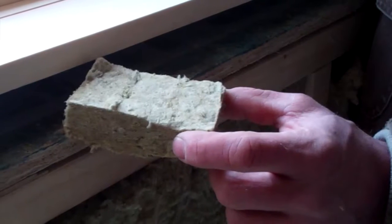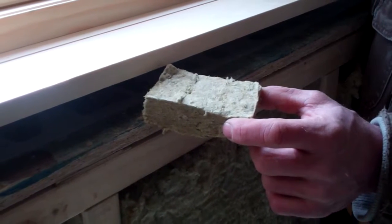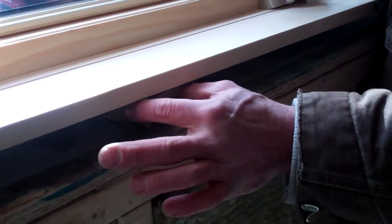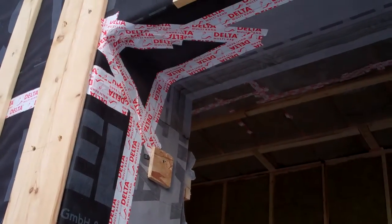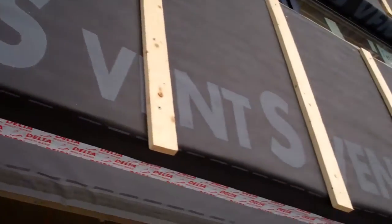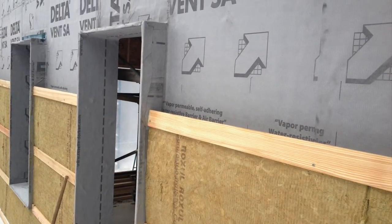Another idea is to replace those wooden blocks with a piece of insulation — foam if you've got it. In this case, we used small pieces of leftover Roxul rigid comfort board. That worked really great. We were able to move them into place, the window sits on them, and we didn't have to remove them, so we have no thermal bridging and there's already insulation in there. We did use blocking where we had to, like for door hinges, but because we have a really deep wall, we were able to insulate on either side of the blocks.